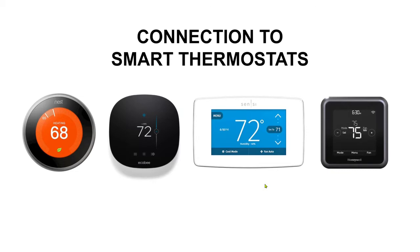One thing which I'll note is important is that an inverter air conditioner, which I'll get to in a few minutes, is different than a regular air conditioner heater. Typically a regular thermostat will not work because they simply turn the compressor on and off. An inverter compressor is computer driven. So we have a specially built board where these thermostats send a signal to our board to turn off, and then our board decides what to do with it after that point.